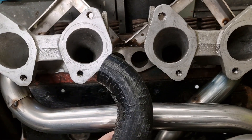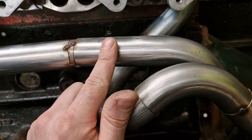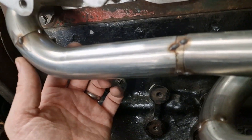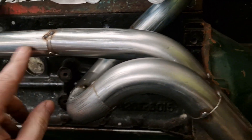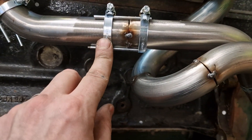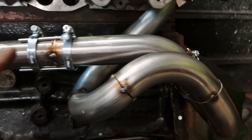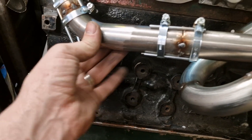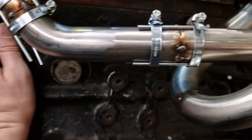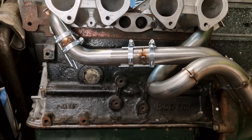I've had a look and this is going to have to be cut down quite a bit for number two. The more I look at it the more I'm not happy with number one, so I'm going to go back a step and make a few adjustments off camera - I'm trying not to make this thing long and boring, which is impossible. It's been about two hours - it took a lot longer than I thought. I came up with a really good idea of supporting it with jubilee clips and tent pegs cut off. I've got three of them on here holding it level, which is enough for me to tack weld it. Really happy now - I didn't actually have to add anything in, just moved a tiny bit from here. It's in and supported, so I can crack on with two and three now.